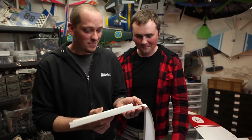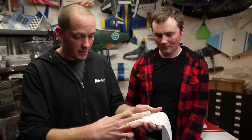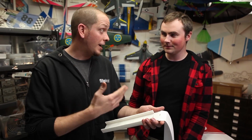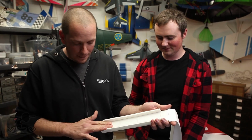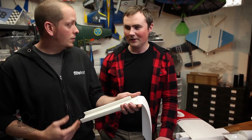All right. The beautiful thing about this, you do not need to use a GoPro. You can use a board camera. You can use anything you want. But I like using this cavity space. You're going to have roughly about 4 inches of open area. I'll pack my battery back here. I'll pack my video transmitter, and then let the antenna come out the bottom. And inverted V's, 5.8, all will be nice.